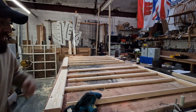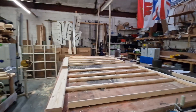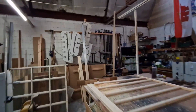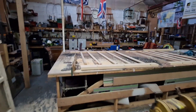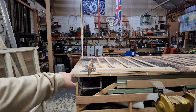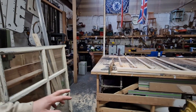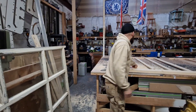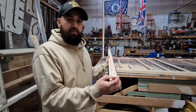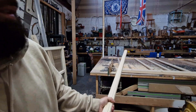Now I'm going to turn this timber into a window. I've done all my machining already — I have a handmade Festool router table, spindle moulder, whatever you want to call it, that I've engineered a router top for myself. I've created my moulding to match an existing sash window, used my cutters to match the profile, machined the glazing part on the table saw, and done the detail on the router table. Now I'm going to make it all fit together.